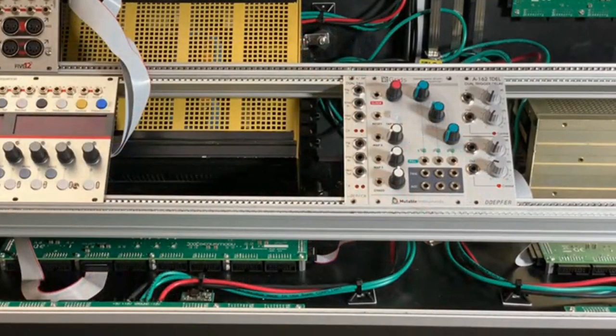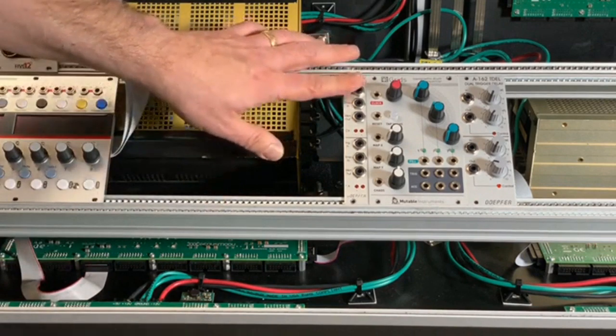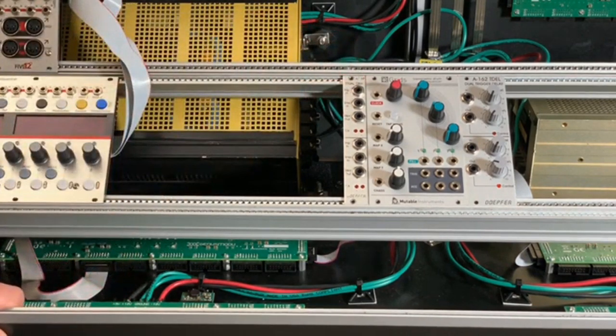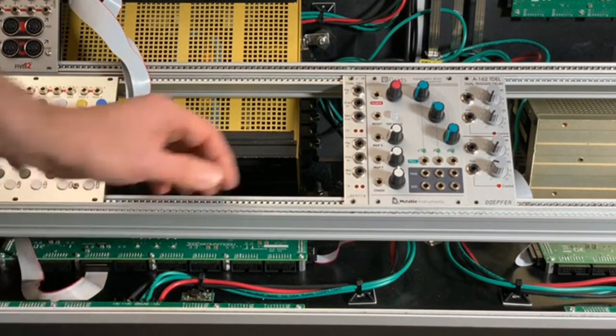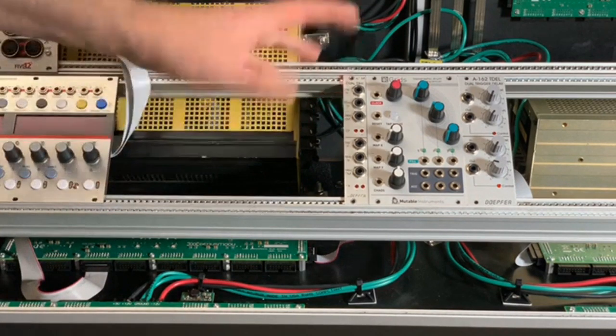Yeah, so it's one of my favorite things, using patterns as opposed to steady clocks to trigger sample and hold. It's much like randomly plucking, say, a string or hitting a drum, where every one is slightly different, but it's not a case of if a long note plays, you continue to hear this doo beep boop boop beep boop boop beep kind of, the sample and hold randomness continues. Yeah. It's definitely a tip I'd say for anyone with sample and hold, is to use rhythmic sources in time with your patterns to trigger them rather than clock them. I think clocking on many sample and hold modules is misleading in that regard. People think, oh, I'll clock it, here's my clock of some division. And for what it's worth, the Doepfer says trigger in instead. Go Doepfer.